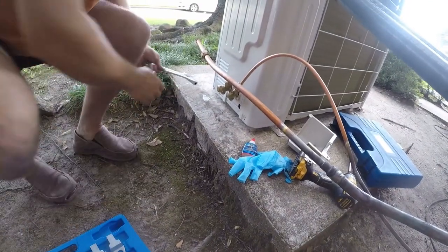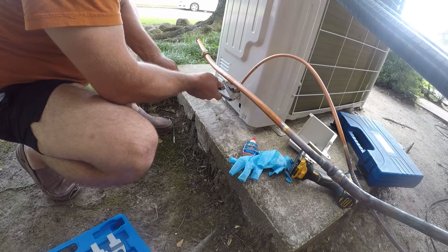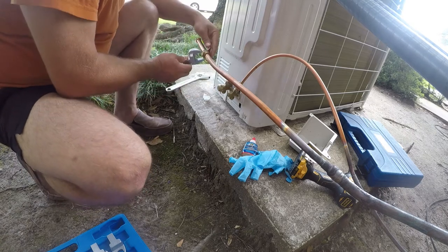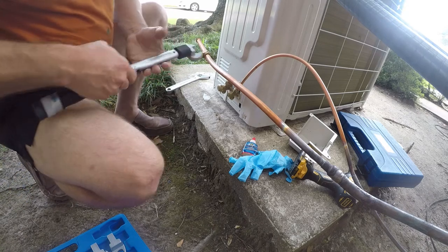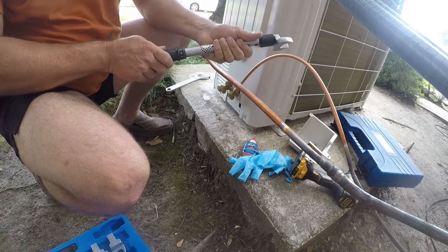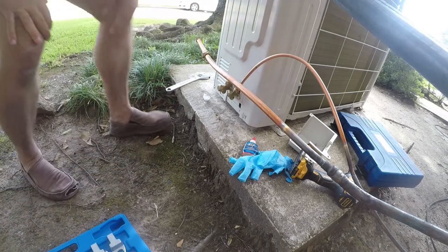So it calls for 20, it's only 20 foot-pounds. So we're just gonna call that 20 foot-pounds. Now, what's 5/8? 5/8 is 27, and we have that one, so we'll use this one. And this one calls for 34. And this is a nice, nice tool. So we are currently set for 25, so we'll unlock it, and we'll just... Zero, one, two, three, four. All right, it actually calls for 33.8, but I'm gonna take it to 34. If it can handle one, it can handle the other.